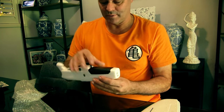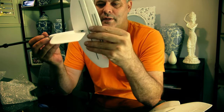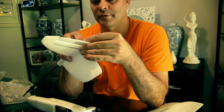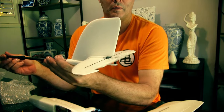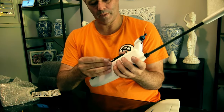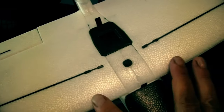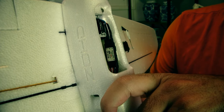There's a little carbon fiber boom and a little tail piece. The elevator just slides in like that - you should have a screw which goes into here, and a control horn. That just locks in and then your tail is solid in the back. The spar goes in like that and does the same thing. The wings clip together and are held together by a screw in the top. It's a 30 amp ESC branded ZOHD. I'm not sure about the servos whether they're digital or analog, plastic or metal geared.